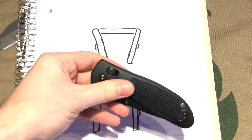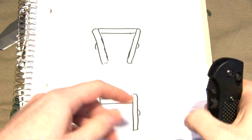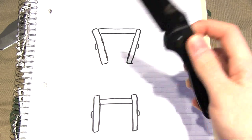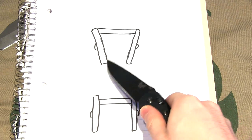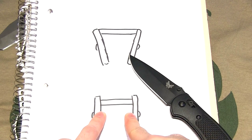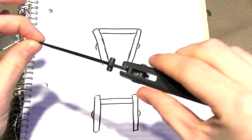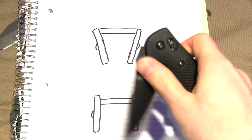That's why people get these knives with tons of blade play — when they tighten the pivot to eliminate it, the blade becomes literally impossible to move, because it's sandwiching the washers so hard at one point. Yet there's still a big gap up here allowing blade play. It's almost a contradiction: tightened so hard the blade can't move, yet still blade play. All we're doing is pushing the liners together so they're perfectly parallel, so you can tighten the pivot to where there's no blade play and still use the knife. I literally can't muscle any play into this — it's solid as a rock and still smooth. No force necessary to get the blade to fall.